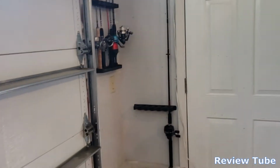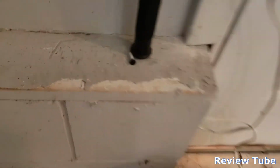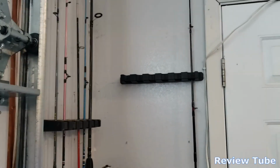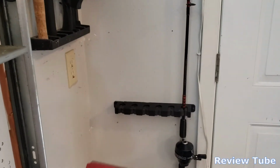Okay, I forgot that we have this almost 1-inch thick drywall in here, so that defeated these tiny little screws they gave you. So be prepared to come up with your own source of fasteners, and these work just fine, the long ones I had. It gets through the drywall into the stud on the right and into the anchor on the left.